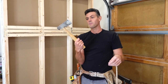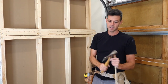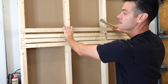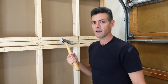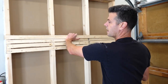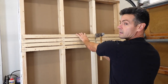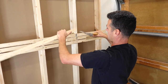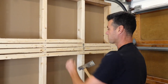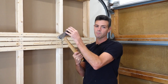So finally, we're going to get into why this is called a lathing hatchet. I've mocked up some lath from lath and plaster. This hatchet is a carryover from the old-school lath and plaster days. When guys were installing thousands and thousands of strips of lath, they didn't have cordless circular saws, and cutting each piece on a table saw would have been ridiculous. So instead of cutting it, they'd give it a quick chop and carry on nailing it off with much smaller nails — I'm sure it was like one strike to set, boom.